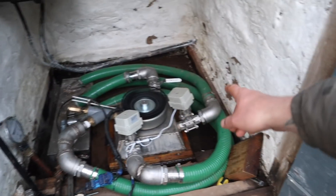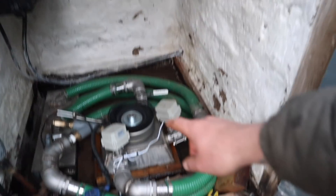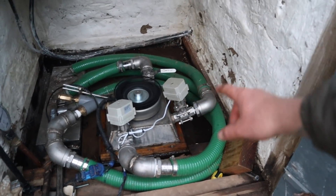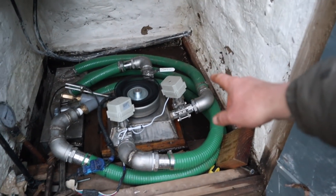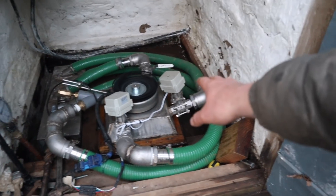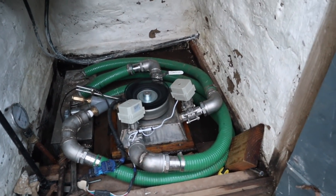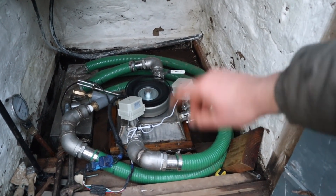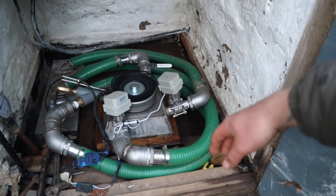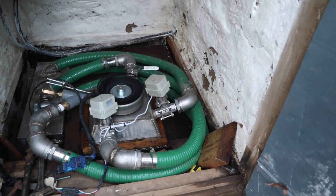I'm going to turn off the spear valve and run that one just on its own to see how much power it produces, then switch everything off and let the turbine free spin and measure the free spin voltage off one of the phases. That will be accurate for doing one nozzle - it wouldn't be accurate with all of them on because the amount of water and splashing is too much in free spin, but on one nozzle it should be fine.